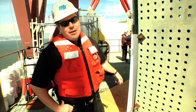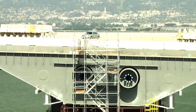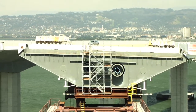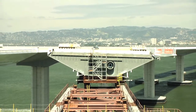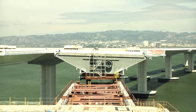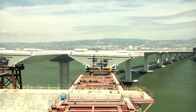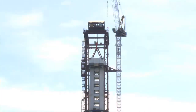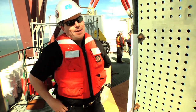We still have four pieces that have to go in place on the eastern end of the suspension bridge before we can start cable work. While that's being done, we'll test fit the architectural tower head sometime in July just to make sure everything fits. That will be taken back off because it gets in the way of the actual laying of the main cable. Then at the end of the year we'll put in a footbridge that matches the geometry of the cables so that we can begin cable work. We're finally connecting things, and commuters driving home today will actually see roughly the full height of this tower for the first time — we're going to be at 525 feet ultimately, which accounts for the saddle and the architectural head on top.